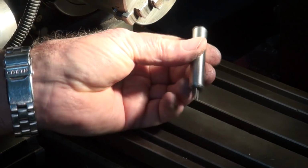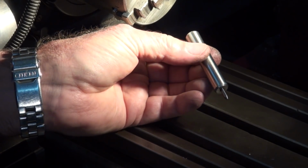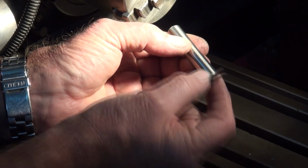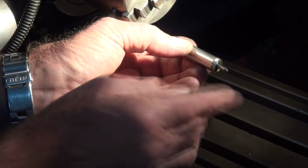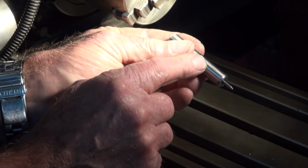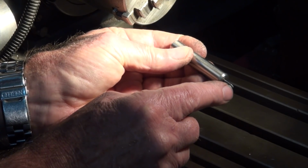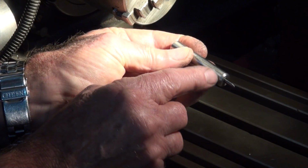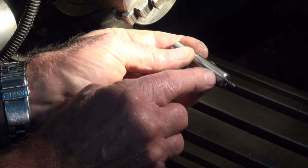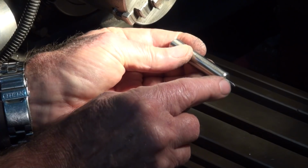Okay, the diamond drag engraving tool that I'm using is one that I bought on eBay. I think it costs about 100 Australian dollars. It came from England. It comes with a spare stylus, and the stylus, in this case, this one has a 90-degree tip, and the stylus is spring-loaded inside the body, so that it's got about 8 millimeters of travel. When the stylus tip comes into contact with the work, it will keep pushing up into the body, so there's no danger of breaking the tool unless you overdo the travel. It also means that you get a constant force of the stylus against the work.